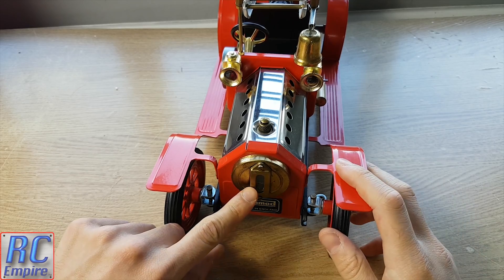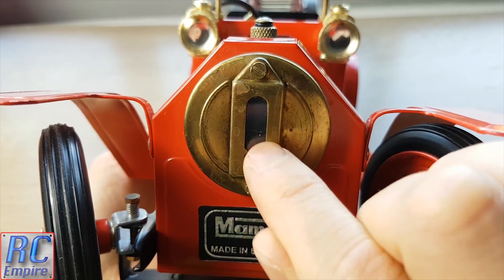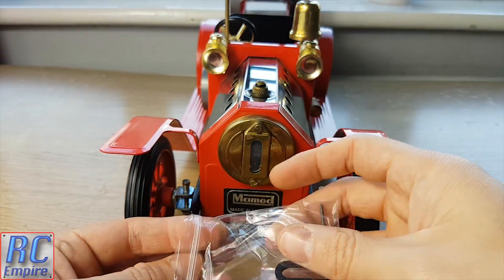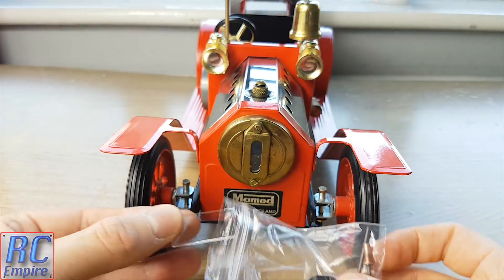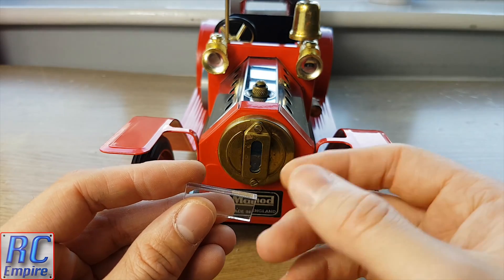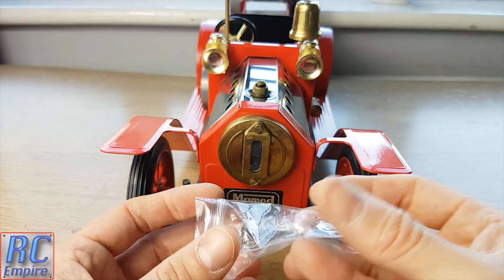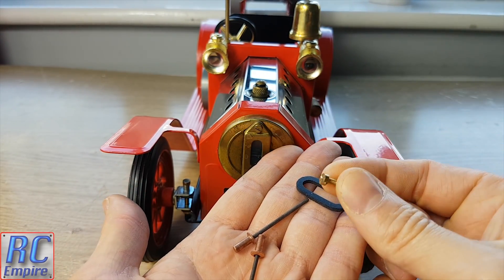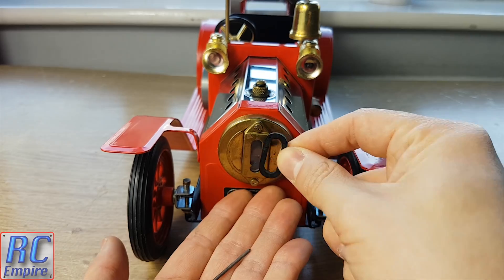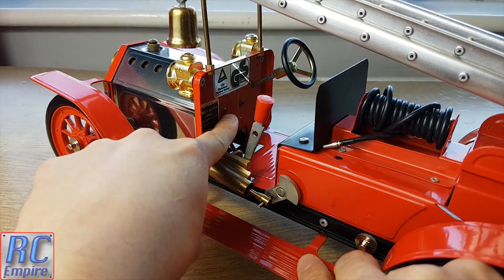For the second part of the video, we're going to be replacing this front water level glass. As you can just see, there's a little crack running across the middle of it. It's not a big crack and I don't think it will affect the running of the engine, but it's nice to change it. In this little service bag you can firstly see the new section of glass. Remember, this is a pressure vessel, which is why the glass is so thick — it is there to hold pressure in as much as to act as an inspection glass. In the packet we also have two new brass screws which hold the cover on, a new rubber seal which sits behind the glass, and two copper rivets which hold the boiler onto the dashboard.